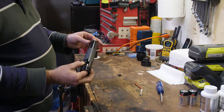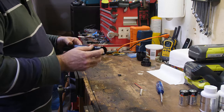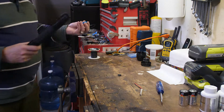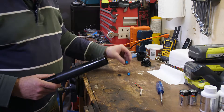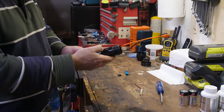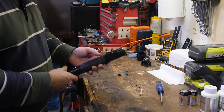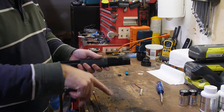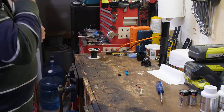The body itself — we're going to drill a couple of holes in the side here for the intensity controls. I have a couple of metal knurled knobs that I'm going to modify so I can drill through them. The knob basically works on a touch capacitance property — it doesn't matter really what it is, you can make them out of just about anything. The fact is that you touch it and you ground it, like those touch lamps or the touch capacitance screen on your iPad. It's all the same principle.